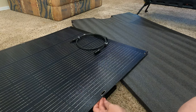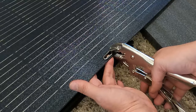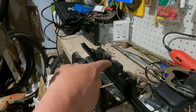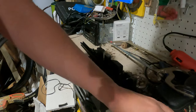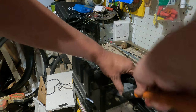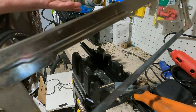For the eyelets that are too thick for the screws, I use pliers to give a light squeeze — just enough to flatten it without damaging the solar cells. To cut the extruded aluminum I use a simple lumber cutting block and a fine saw. I use a piece of rubber with a big wrench to hold it in place and make the cut, which only takes a minute or two. You don't need a $300 saw for this.